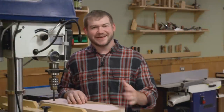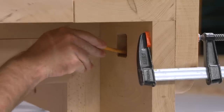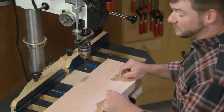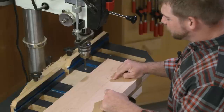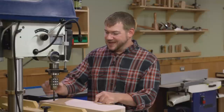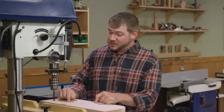After cutting the corners at the bandsaw and cleaning them up with the edge sander for a nice smooth radius, I clamped the jaw onto the front apron in the location it's going to go. That allowed me to reach back through and mark two different locations: the first for the wooden screw that will pass through the jaw, and the second for the support arm that goes through the apron. For the support arm location, I had to reduce the area a little bit because the arm is going to have a shoulder on it — so we cut this about a quarter inch smaller all the way around.